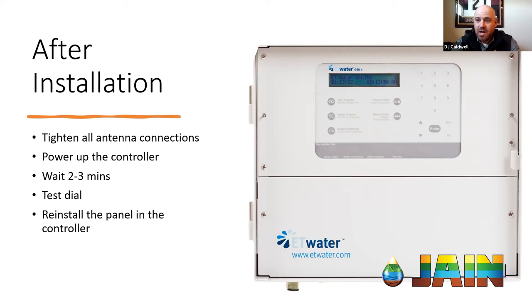Once you're comfortable with that, it's time to repower your controller — whether that's reinstalling the clip with the three wires or plugging it back in. Reinstall the power, then you're going to need to wait about two to three minutes for a couple of reasons: that new modem needs to reach out and find the closest cell tower, and that new SIM card installed in the modem actually needs to register as well. So there are multiple things going on in the background. Then once you've hit three minutes, you can press the test dial button. You shouldn't have any problems getting the communication to go through. Very rarely the first communication doesn't go through, but if you wait 30 seconds and try again, it'll connect right away.